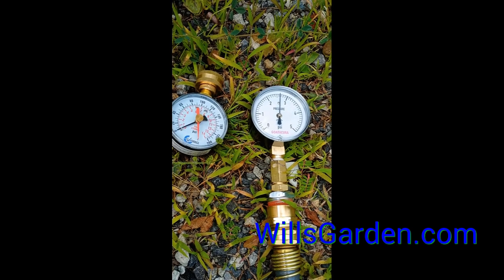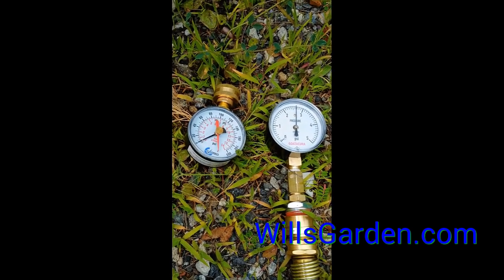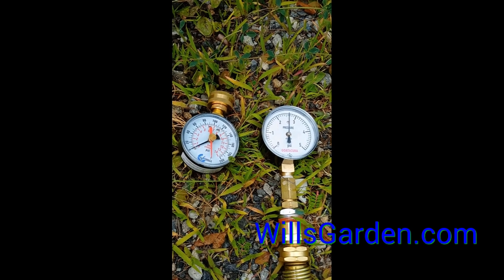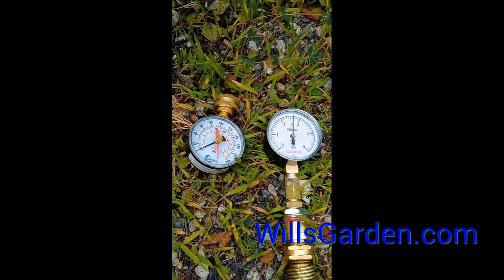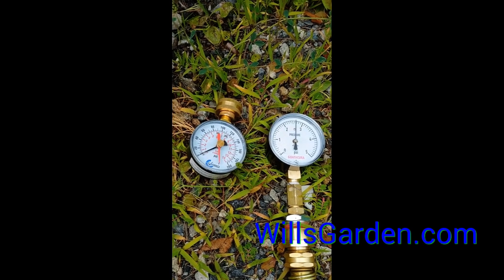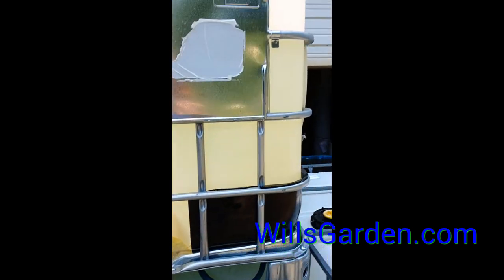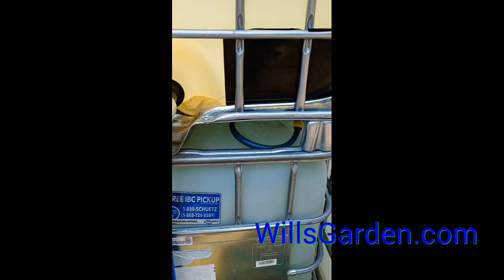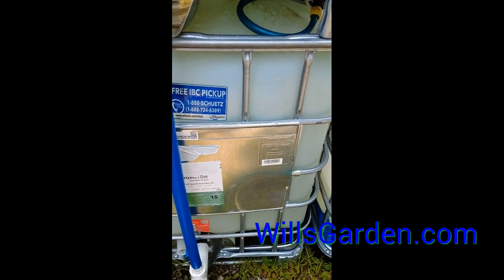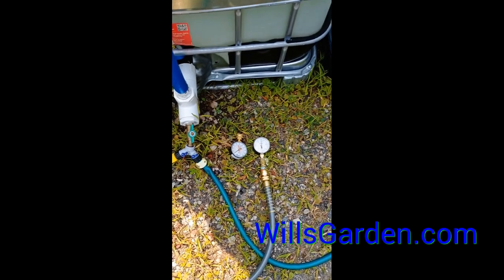Check out our other videos on pump solutions. The other reason is water seeks out its lowest point — that means it's only going to work if the hose is lower than the level of water in the tank. Right now we're running at about six feet of water, so if you're holding the hose at waist height, you're really only going to be getting about half a PSI. Just a little food for thought.